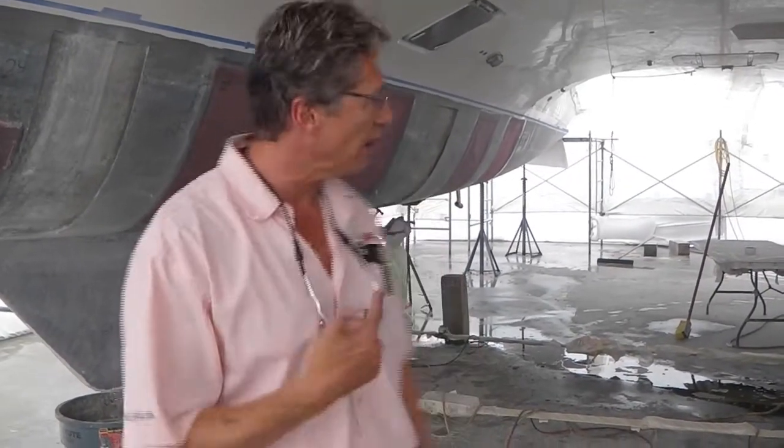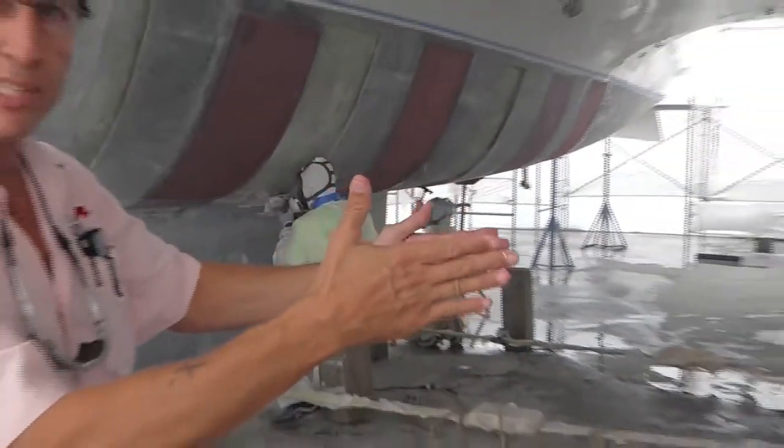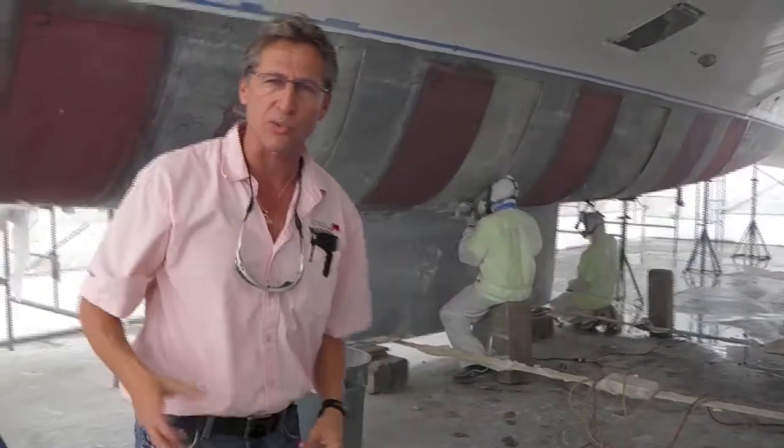It's the more part of our September videos. And if you've been watching our other project here, we have a catamaran that we're cutting the whole bottom, vacuum bagging and replacing all the cores. So if you look behind me, you can see they're cutting out different sections going from back to forward and not doing them continuously because it might weaken the strength of the boat.